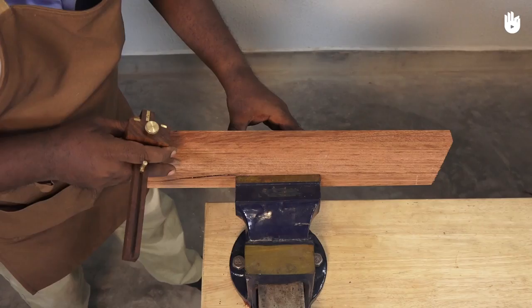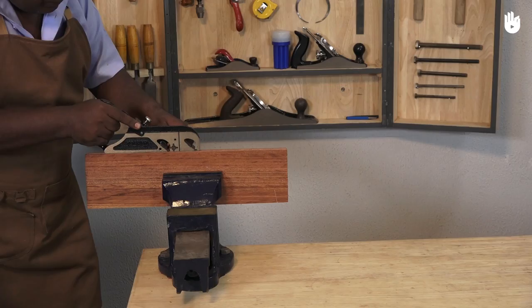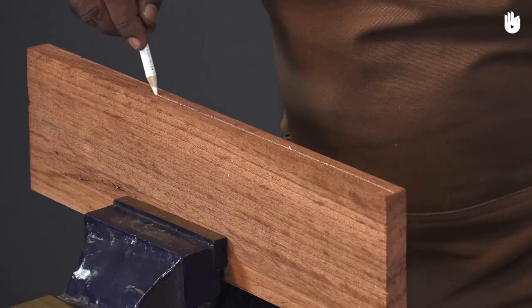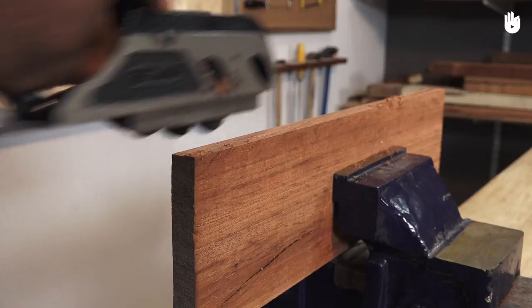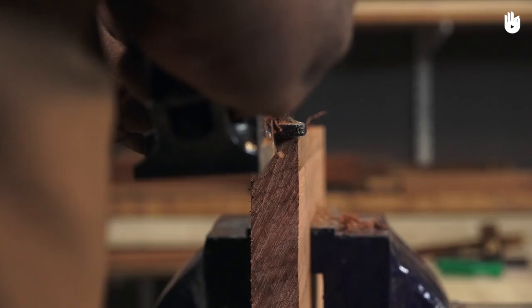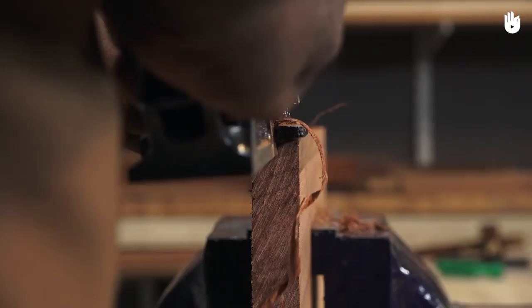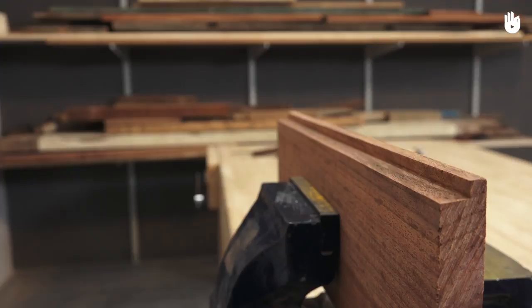To make a rebate, first use a marking gauge to scribe along the width of the groove that is to be planed. Use a pencil to highlight the line. Tilt the plane slightly and place the corner of the plane into the scribed line for a resting place. Keeping the corner of the blade inside of the V-shape, start working with the plane held perpendicular all the way down to the desired depth.